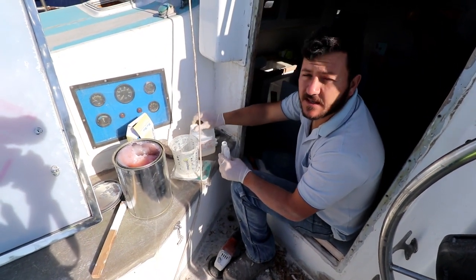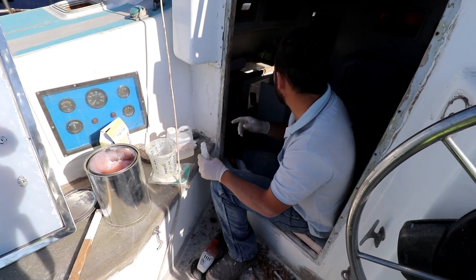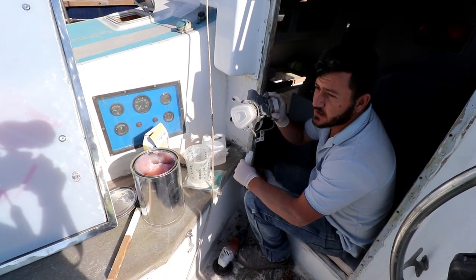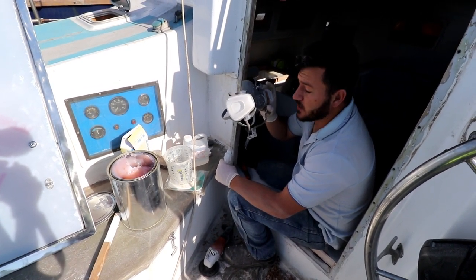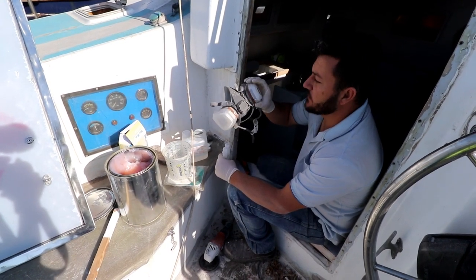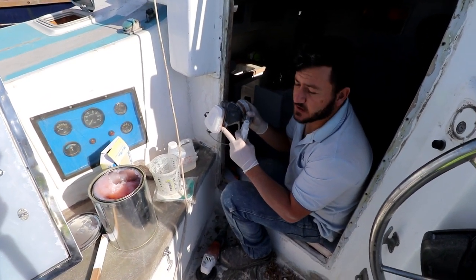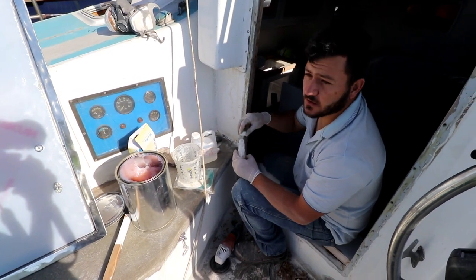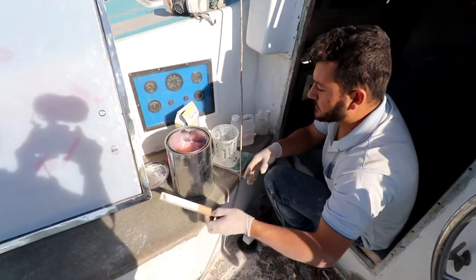If you're not in a well-ventilated area, I'd recommend you wear a mask when doing this. If I'm in the back bunks, I'll wear one of these - I've got three masks especially for working in confined areas. Firstly it's going to give you a hell of a headache otherwise - it's unbearable and uncomfortable. Whenever I'm grinding fiberglass I wear this. I've had it once where I didn't and my lungs hurt that evening, so I wear this all the time. I've got different cartridges - this is for fumes and gases, and I've got one that's for dust particles with pre-filters. Stuff works super well, definitely worth the expense. In South Africa that's like $120 - I don't know the price overseas but they're worth it.